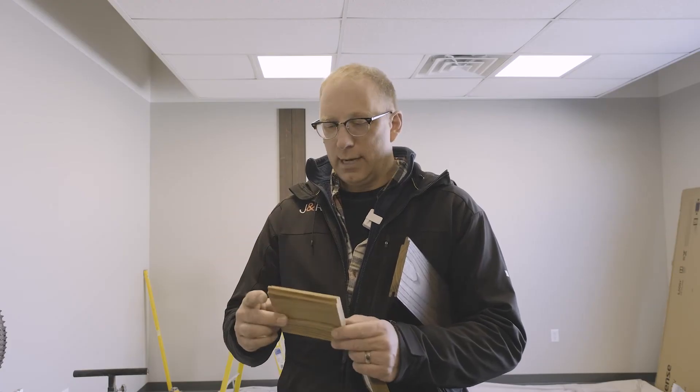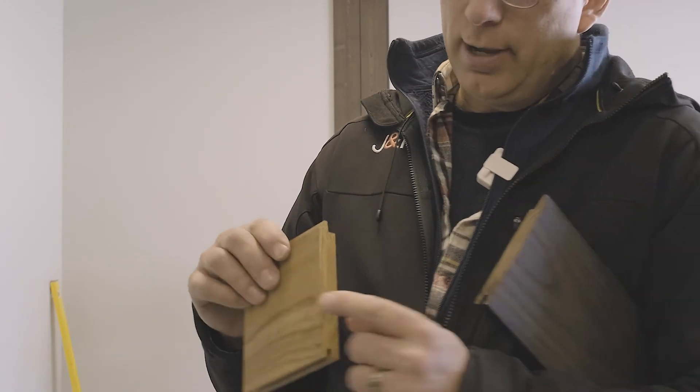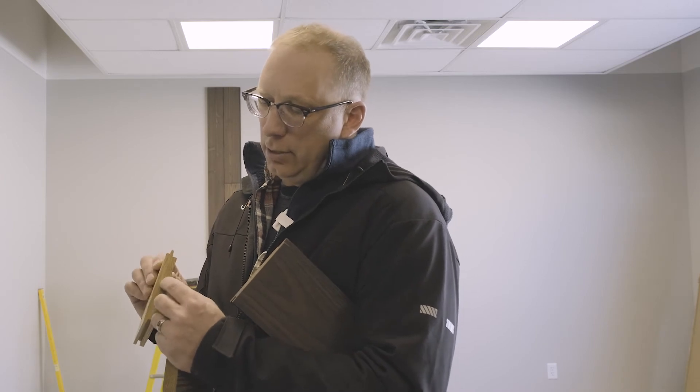The really interesting part is that versus other chemical treatments, it works really well in hardwoods — which none of the chemical treatments work on, except for the really nasty ones. This is a piece of ash from Arbor Wood, their 190 series, which refers to the heat recipe used on it. It gives it this uniform finish, and it's cooked all the way through — whereas normal chemical-treated wood usually only penetrates to a certain point and never gets all the way through.